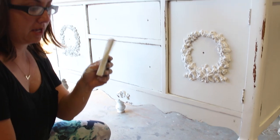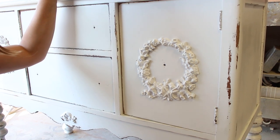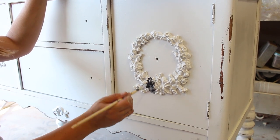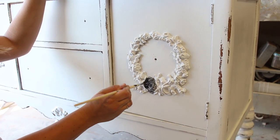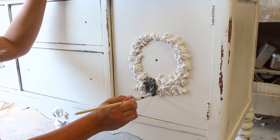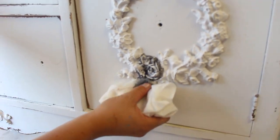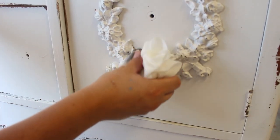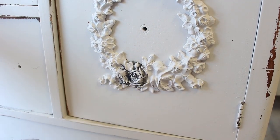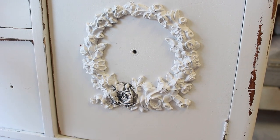We're using our Fairy Chalk Weather Glaze. On hand I have a magic eraser in case it gets too crazy, and a wet paper towel. I like to use a little artist brush and just get it in all the details. You're probably wondering why I sealed it first — that's because chalk paint is very porous, so if you don't seal it first, the glaze will not come off. The whole idea is you just want it in the details. I've got it down in all the cracks and I'm going to do the whole piece and all the appliques like this.